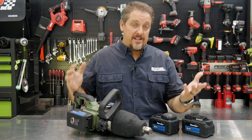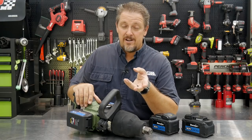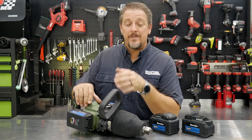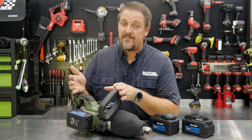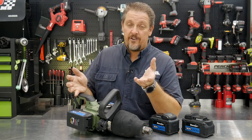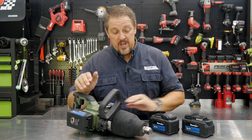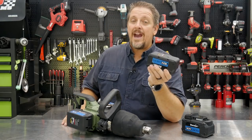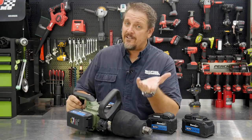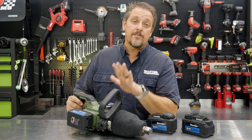We weren't able to do a whole bunch of testing on this because we need to get bigger bolts still. We just upgraded to 1-1/4 inch bolts about a year ago, but those will only run to about 2,000 foot-pounds — and they're not going to hold up to the 2,500 foot-pounds we need to test this. We did everything with the 2-amp-hour batteries, and breaking free even the 2,000 foot-pound fastened nut, this had no problem doing that.